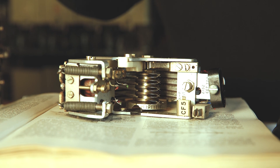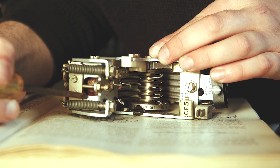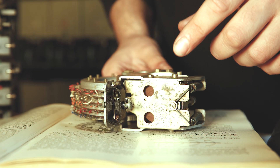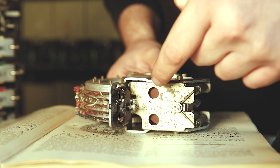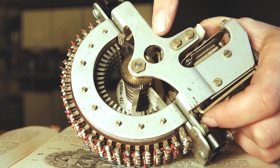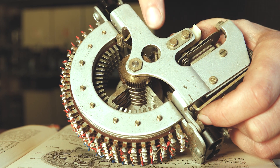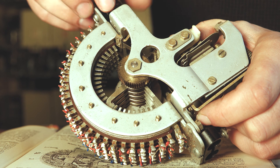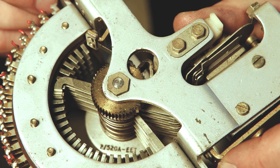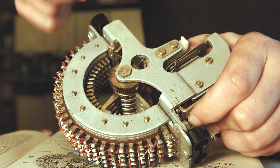We want to move it with electricity. How do you do that? Well, you do it with electromagnetism. In here, if you can see this brown bit just inside there, that is a big massive coil of wire. You put a current through that, it makes a magnetic field and moves this big armature plate here. This armature is connected through to this pawl — P-A-W-L — which is part of the ratchet system. It indexes with the teeth on this cog, and as you move the armature it moves the pawl round and pulls the cog round, which moves the wipers around the bank of contacts.